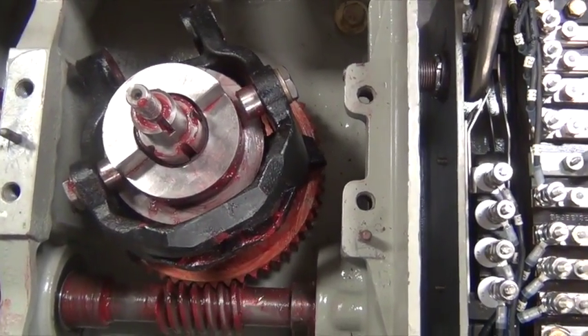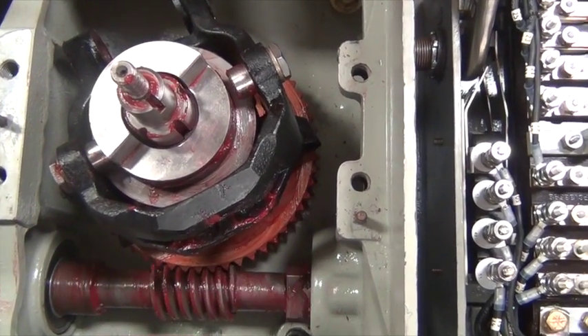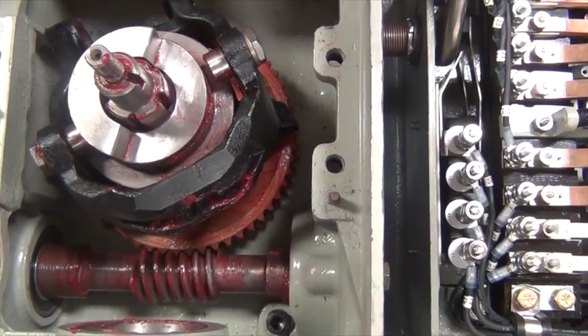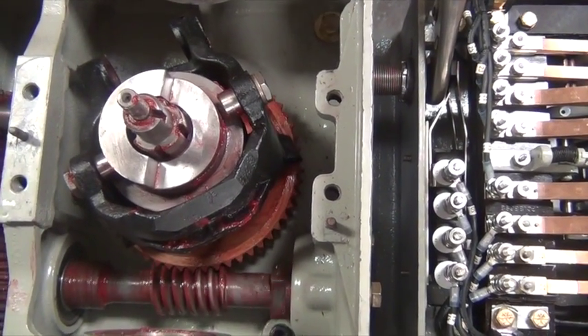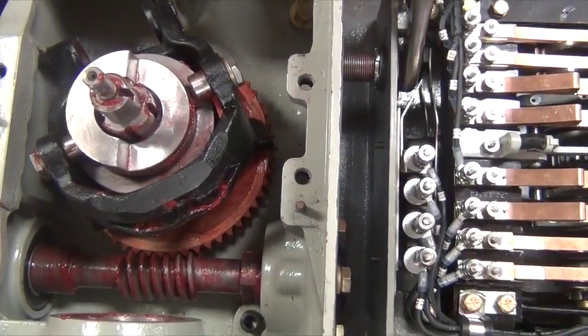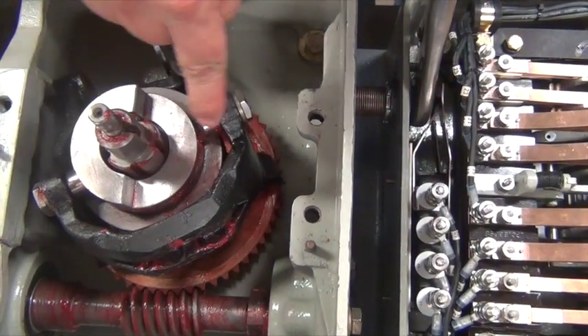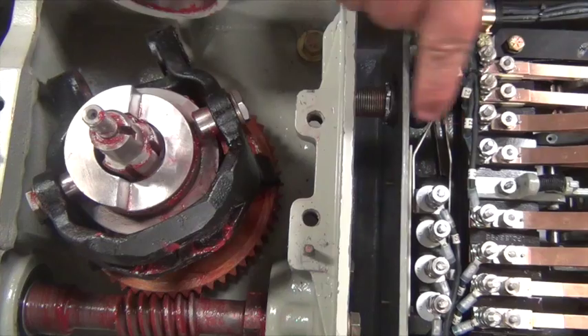To facilitate timing and reassembly, it will be necessary to hand crank the machine to the precise midpoint position. Make sure the machine is shifted to motor and hand crank it until the keyway on the top of the crank is oriented on the center line of the machine and toward the contact end of the machine.